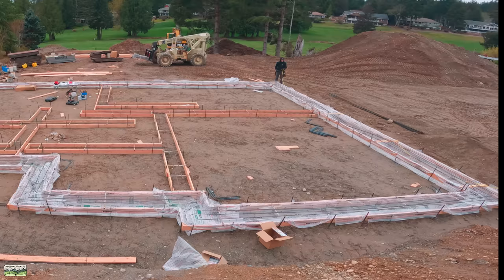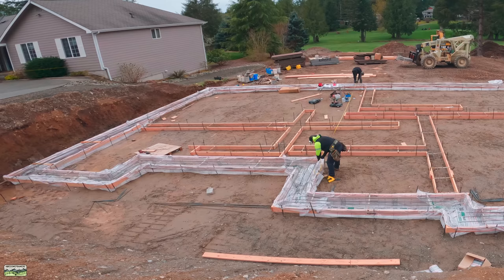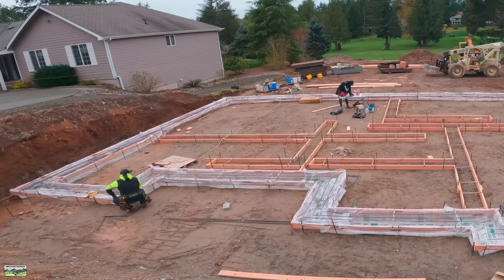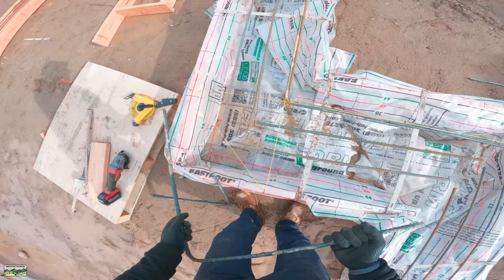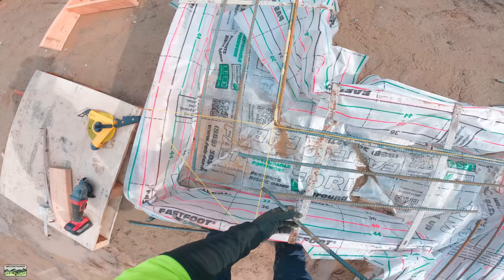It's just a matter of communicating with each other. In my case in the foreground, I'm going to call out the number out loud - that's going to help me remember what it is. Kyle's going to listen and correct me if I get something wrong. He's making sure that his tape measure is parallel and not wonky, because that will affect the length. At this stage, now that we've lifted to grade, any movement in the footings we're correcting for now with the stem walls. This one was right on the money - everything was within a quarter, so we're making small adjustments. As we go up with the stem walls, we can make more corrections.